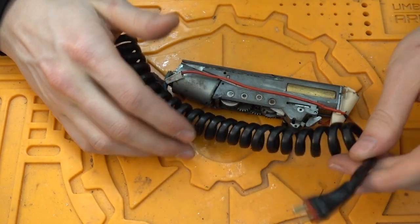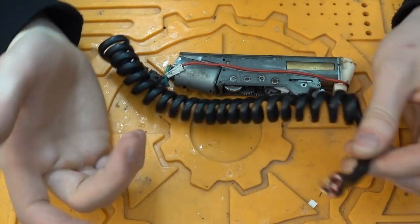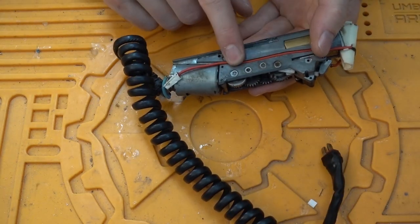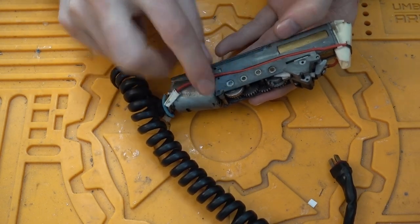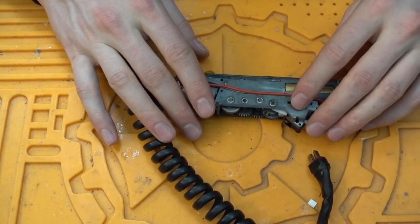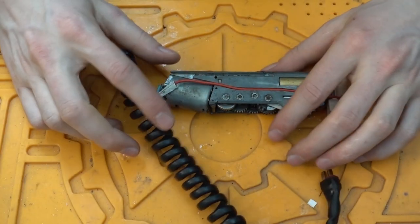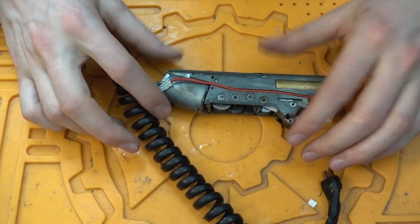Now that you have the cable, you also have to get whatever connector you prefer — mini Tamiya, large Tamiya, or Deans in my case, because that's what I use on most of my batteries. Then on top of that, you also need wiring — this one is 0.75 square millimeter, which is the biggest that can actually fit into those tiny grooves. You can buy those in any DIY electronics store or on Amazon. I will leave links to all those things in the description.